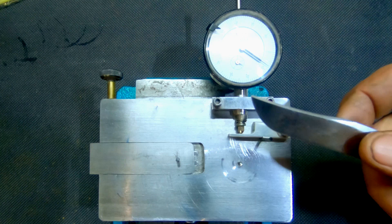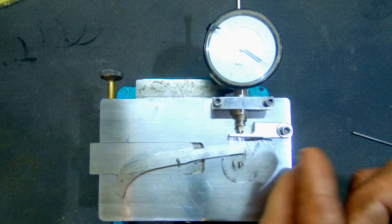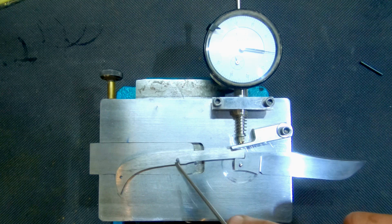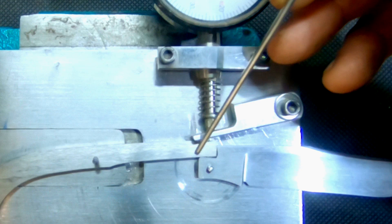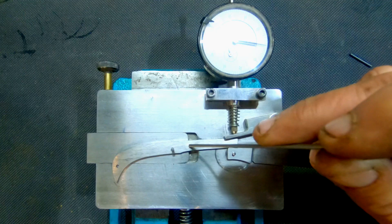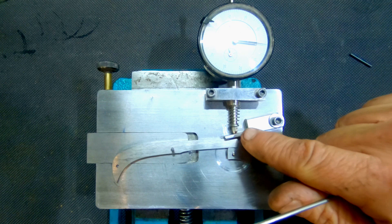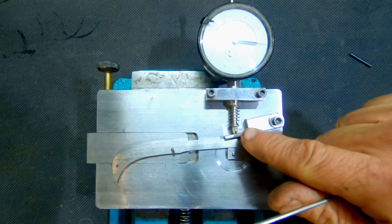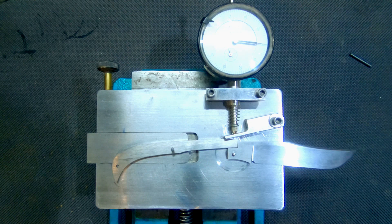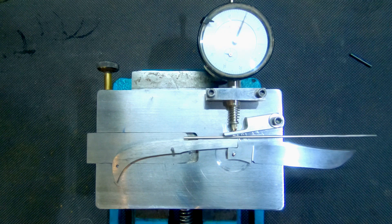When we begin the setup, our aim is to check the knife and make sure it's in all the proper configurations. It only has one pin for the center of the spring because the actual position of the spring is generally irrelevant — what we're really measuring is the relationship going on up here. This will all be stable in the handle and will not move. So when I set this up, I want to put a straight rod right in the spring, and the relationship I'm looking for is that the top of the blade is relatively straight.